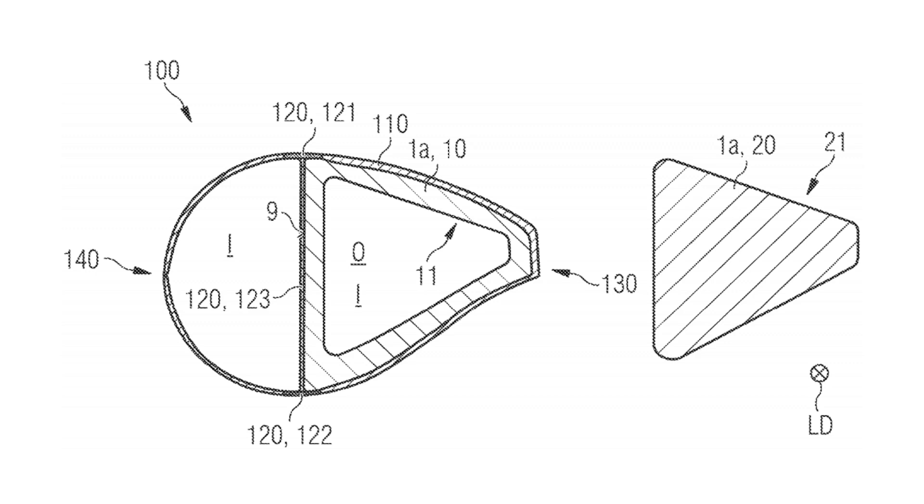Our first idea is what's termed a stability component for wind turbine blades, an idea from Siemens Gamesa. In patent form, they describe it as a novel approach to stabilizing wind turbine blades without the need for traditional trailing edge beam designs. What they're really doing is installing close-out plates between the aft spar and the trailing edge.